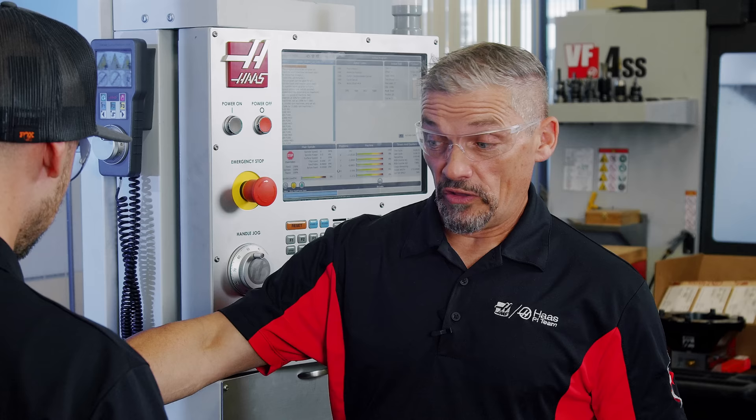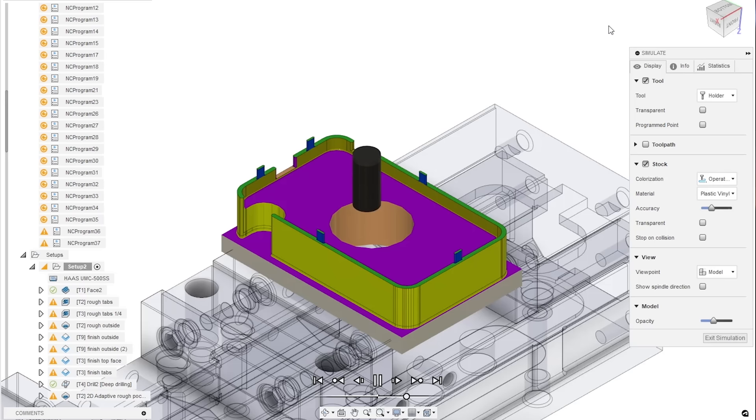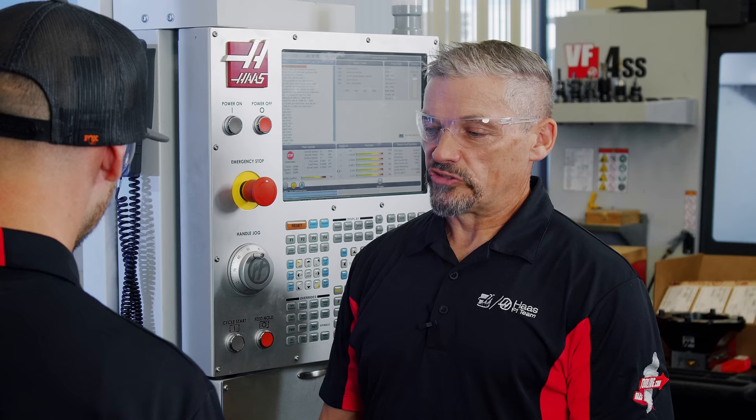When you're finishing, do you come in and do one super light cut on this wall at full depth? You're just finishing each stage. That final finish cut is running a spring pass on the upper two layers, but they've already been cut a few times. So there's really only about a tenth radial width of cut and a quarter-inch depth of cut — a real light cut on these final walls. Then I come in and chamfer every surface, so this thing is ready to go.